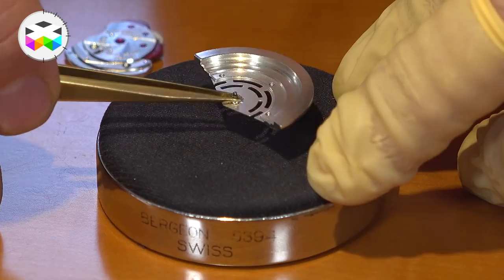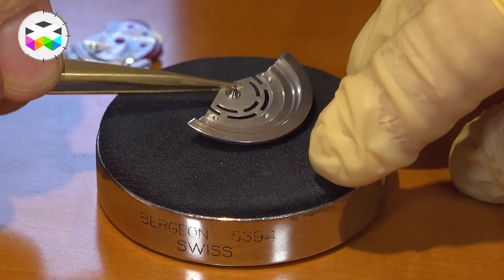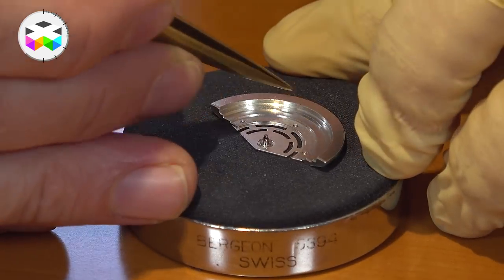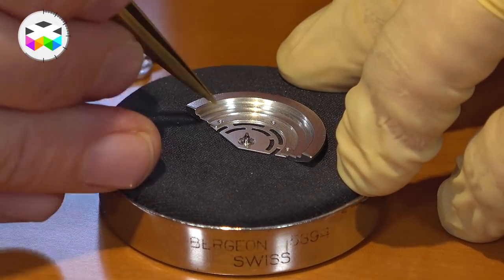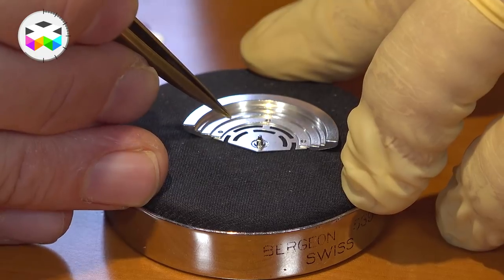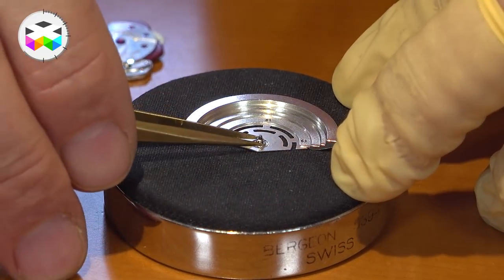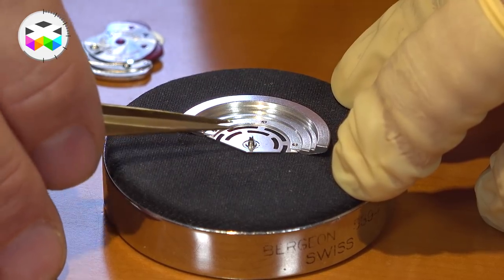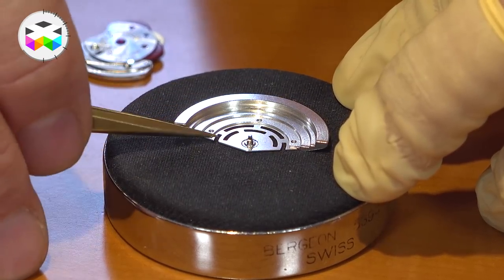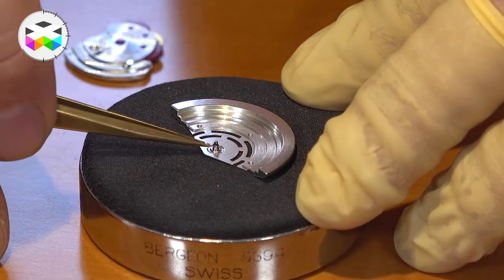Now you see the rotor with its axle in the centre and the rotor is completely free. The outside of the rotor, this section here, is all made from hard metal — tungsten carbide — for weight. It's held in place by these three rivets. Then you have a thin piece of metal on the side with cutouts. The cutouts form a type of shock resistance so that when the watch gets knocked — and as a sports watch it will get knocked — the axle in the centre is protected. All the force caused by that knock and the heavy metal mass is absorbed by this section, protecting the actual axle.